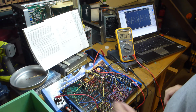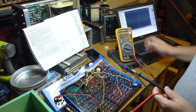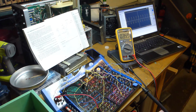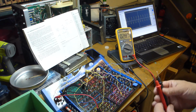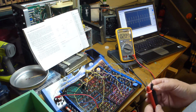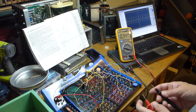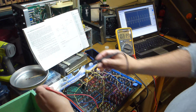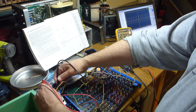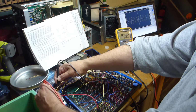So what I was saying was, I've got an RMS voltmeter in the form of an oscilloscope, which I haven't had before, because this 15B Plus, the one you can get for like $90, made for the Chinese market, is a great little multimeter, but it's not RMS. So I wondered what the difference would be. In this particular case, there honestly wasn't that much. 0.521 volts is what it's saying right there.